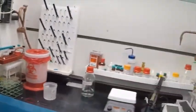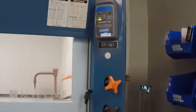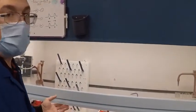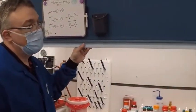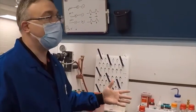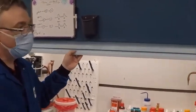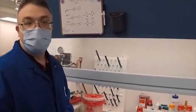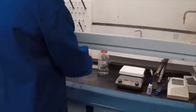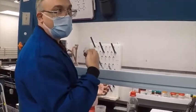The alarm is another safety feature on most fume hoods. The alarm is set for the appropriate height of your sash. When working in a fume hood, you should not work with it all the way open, as this lowers your face velocity and vapors and fumes could potentially leave the hood and come back at you. Your sash should be set at the proper height for your calibration, so you can place your arms inside the hood while still maintaining the sash between you and the hazard, adding another level of protection.